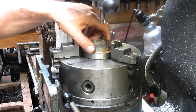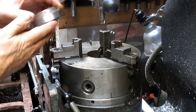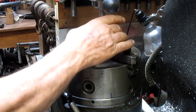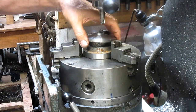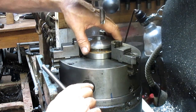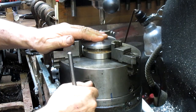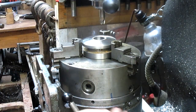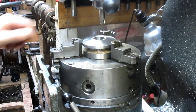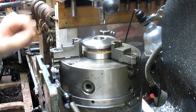All right, so we found a little piece of slug here, and we machined off that top surface, so we've got a nice flat surface. And we brought our table out to, what is it, 1 inch 280 thousandths, which takes us out to the bolt holes. We're set on 0. And we're going to cut our seats first and then come back and drill our holes.